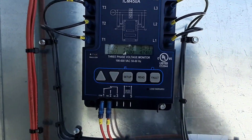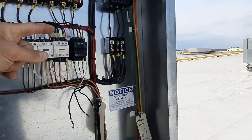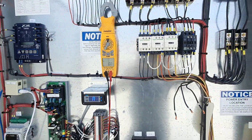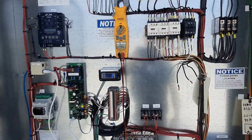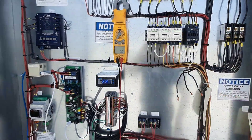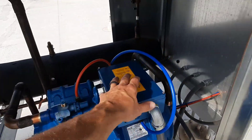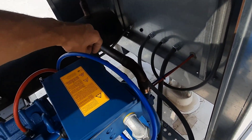I went back to try to push it in again and I got no resistance, so this contactor is jacked up inside. I'm going to try to take the cover off. We've got good phase now — I'm going to wait for this to cycle, because I'm assuming as soon as that contactor pulls in and it sees one leg gone on the load side, it's going to protect the compressor and shut everything down. I'm not going to push the contactor in manually; I'm going to wait for it to do it on its own. I need to figure out the contactor issue — it had auxiliary switches, so I'm not sure about that yet. Everything else looks like it's going to be okay; looking at the compressor, it's all wired right.